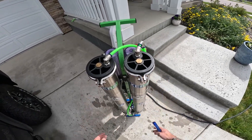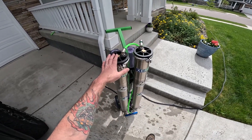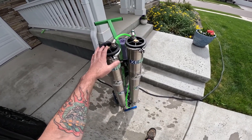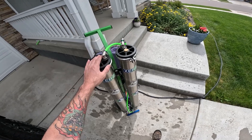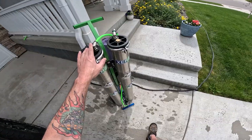In here are the RO membranes — stands for reverse osmosis. This is what removes about 90 to 95 percent of your total dissolvable solids, and when you have two of these, it produces about a gallon per minute with average water pressure at about 50 PSI.